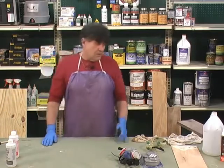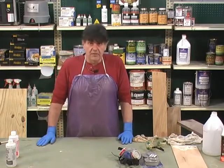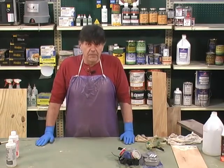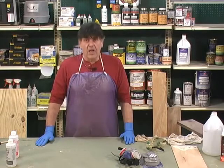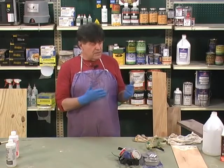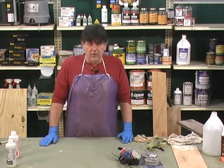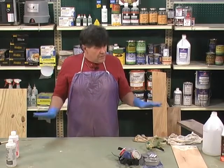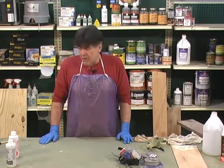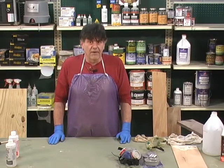My last resort is the wood bleach. That simply has to do with cost. Okay? It's not super cheap. But this is what bleaches do. Now, before you run out there and start bleaching everything, we're going to look at some other alternatives and ways to deal with getting some of the colors that we want. So make sure you get through the DVD series before you go getting a whole bunch of stuff. These are some of my last alternatives. I avoid them whenever possible. But the chlorine bleach, if I get too dark on a dye, it's pretty nice to know about and have available.